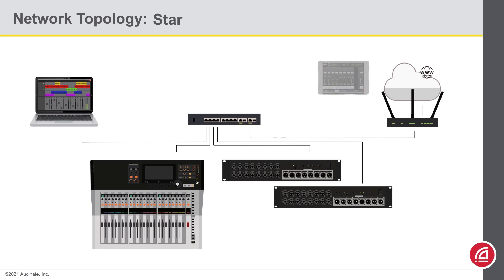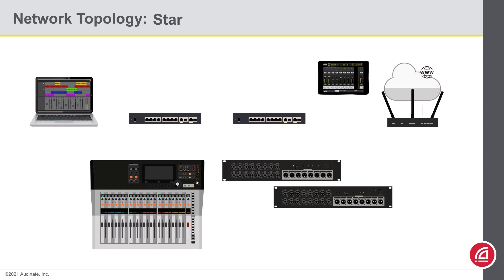This also makes it easier to integrate more ports for things like control as well. And of course, we can use multiple switches without hesitation. Multiple switches will be covered in more detail in Level 2 certification, but you'll notice we already snuck in the wireless router, which often has a switch in it. When multiple switches are linked together, we often call that a trunk line or an uplink.